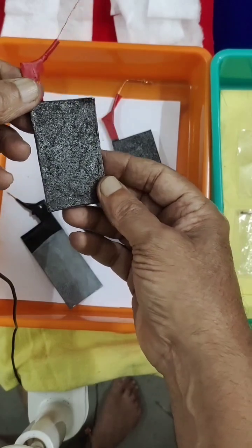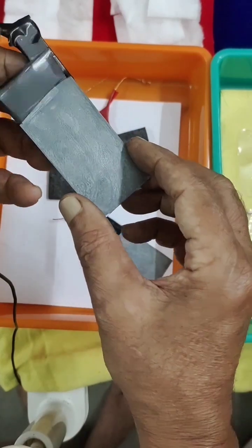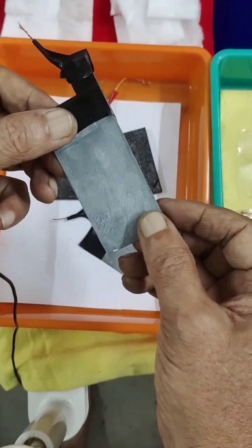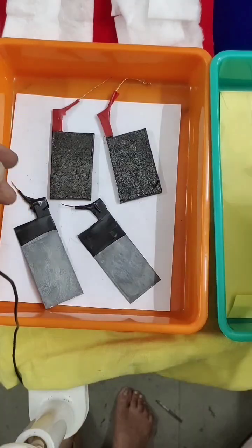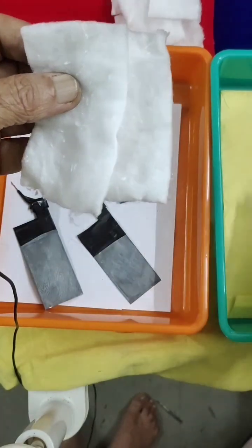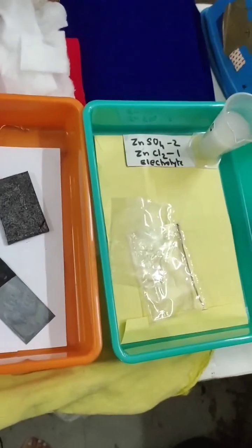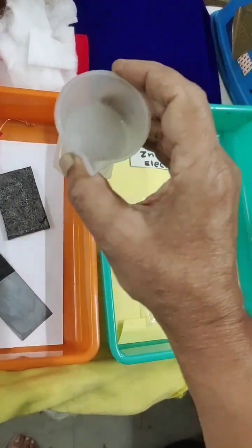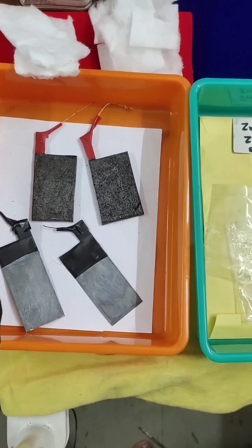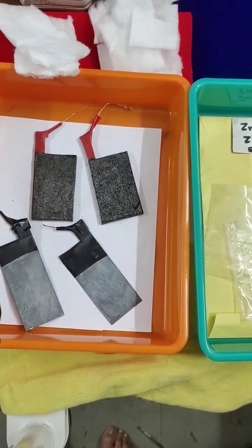This gives good conductance. As usual, this is an aluminum sheet coated with zinc — you can see my previous video on how to do that using zinc oxide and caustic soda. To assemble, I have made a plastic PP sheet. These are ceramic separators. I am going to use zinc sulfate and zinc chloride as electrolyte. In round forms I have done this before and those cells are still running.